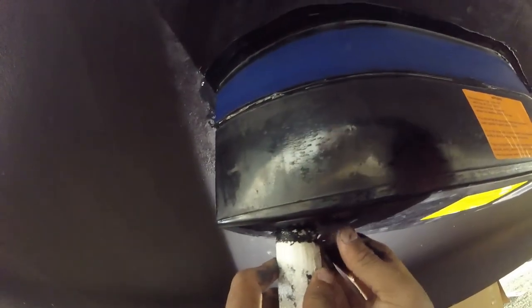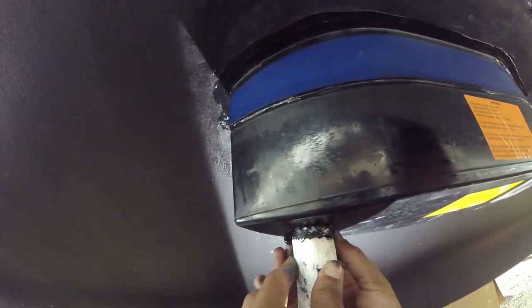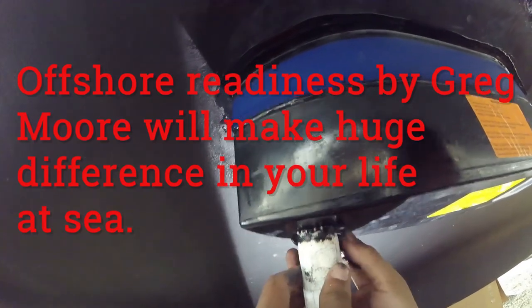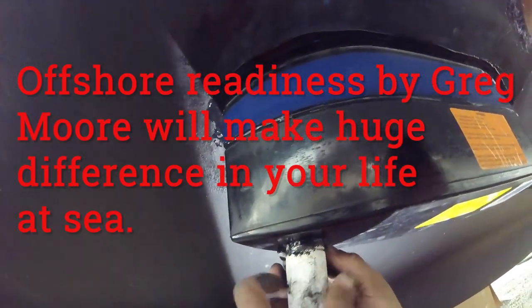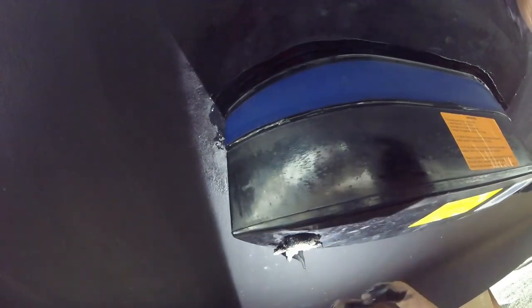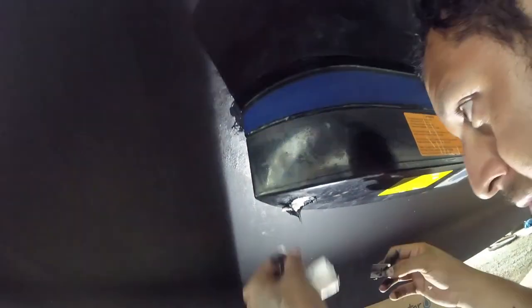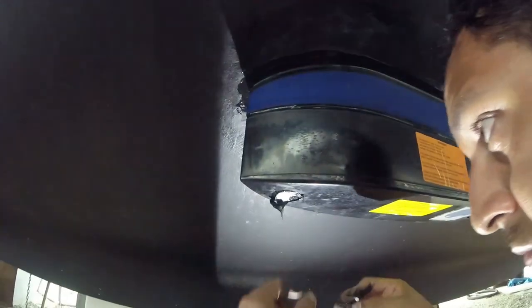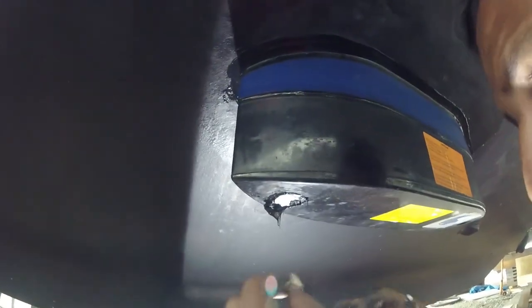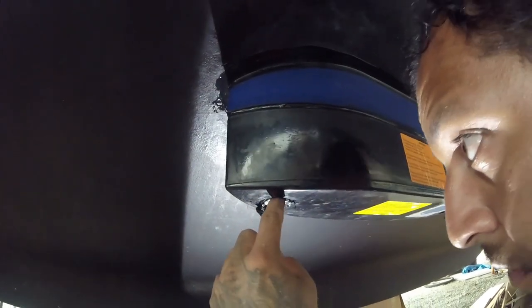And now we're plugging the holes. We have 5200 up there covering the top of the nut and the rod, and we've pushed that in all the way and now pulled it back a little bit, and we're cutting it. That'll leave plenty more space above it when he pushes that back in. Now you're going to pull that back down and cut more off. That's why you have supervision. You got to watch every move. Pull that back down and cut another 3/8 of an inch off that, Danny. Yep.